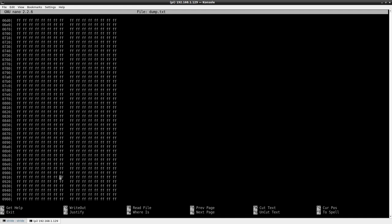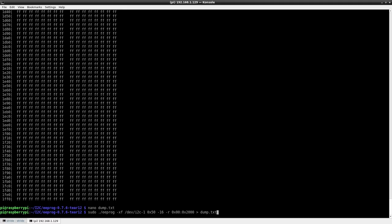Whereas like a lot of hex files, a hex file is different than a binary file. Oh, yeah. Because a hex file actually is like human readable ASCII, you know, FF, A0, B0, blah, blah, blah, along with pointers. So a hex file has to be parsed before it can actually be sent over directly into a chip. But binary is just raw data. I wonder if there's a way that this could just dump the bytes? Yeah.